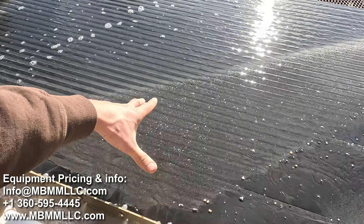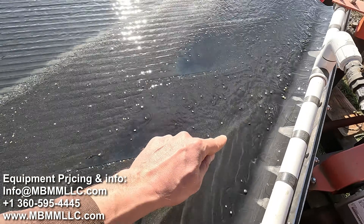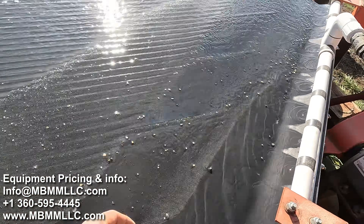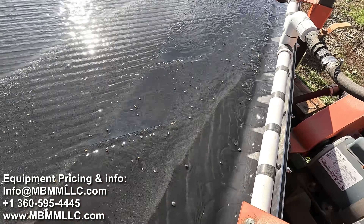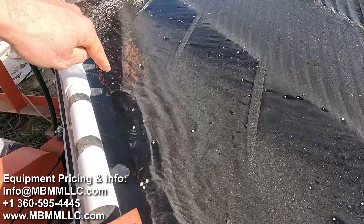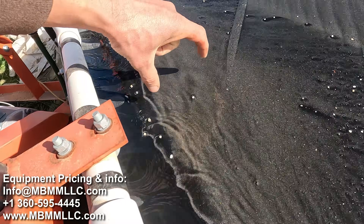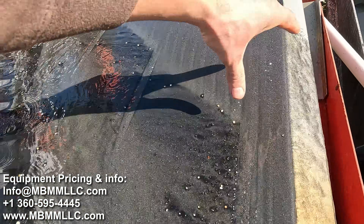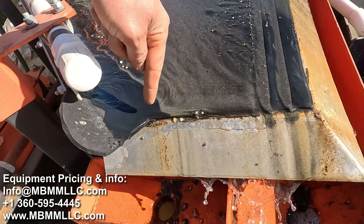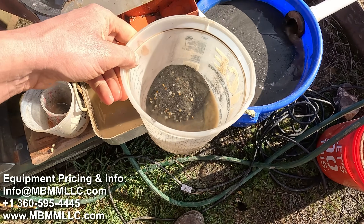This is all number two black sands, mostly pyrrhotite. I'm interested in the very heaviest stuff coming out of the top groove and running down into the number one. Most of this is junk I don't have to pan or deal with, but I want that top one to five percent that has any values that ended up in the number two — I can put it all into the number one. Here's what we're after: that silvery blue-gray line right at the head of the pyrite band. That's the tellurides, and they hold a lot of value, so I wanted to get those out of the number two and right down into the number one.